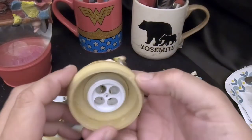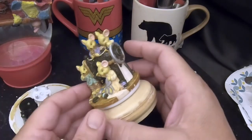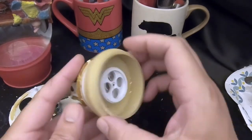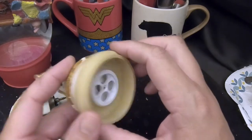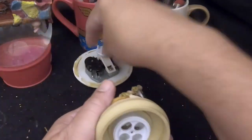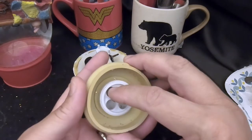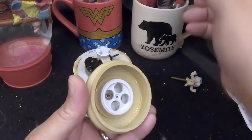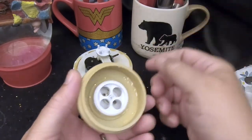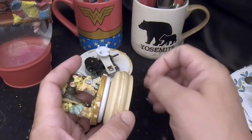We're back. We took the figurine out of the globe off camera — I took it apart and I'm going to explain what I found to both you and Ali at the same time. The mechanism seems to be moving easily by hand or with a tool, but apparently the music box doesn't have enough strength. I think the spring might be weak or there's something binding up right here.